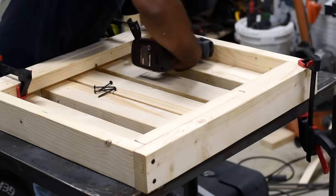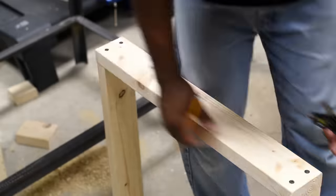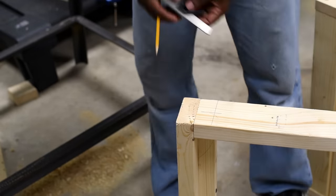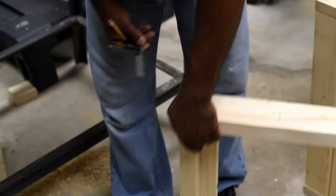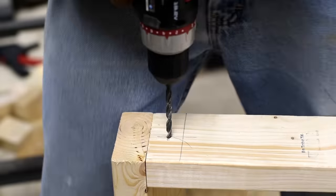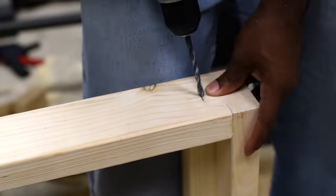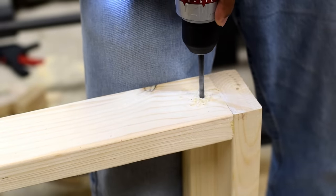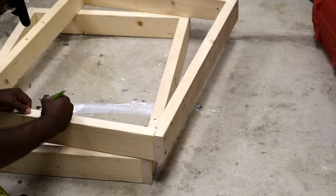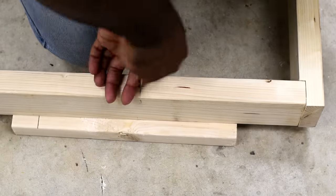The way this chair is designed is suspended by 4 6-inch bolts, 2 at the bottom and 2 on the back. The bolts for the seat are located toward the front portion of the bench, and I'm marking a center point for the bolts to go through. The bolt should pass through this arm and into the seats we just drilled, finished off with a nut and a washer.